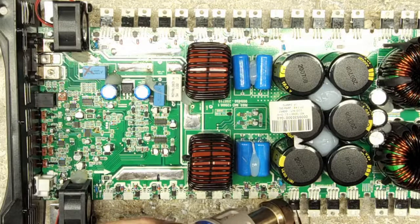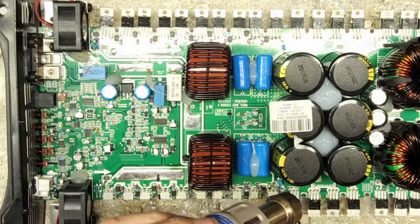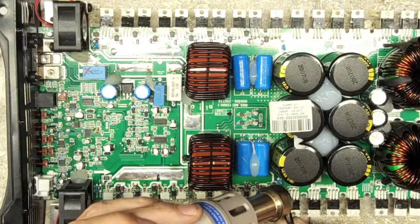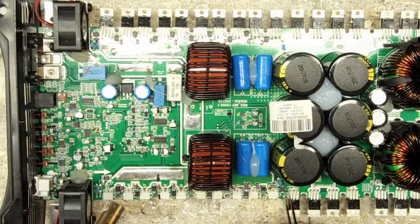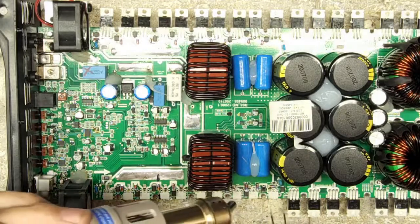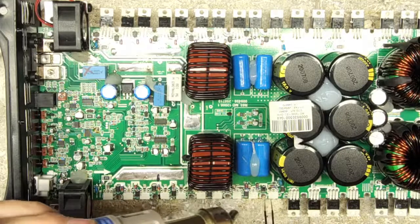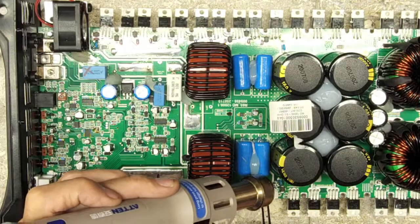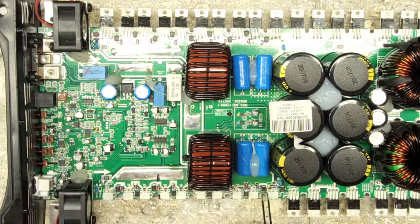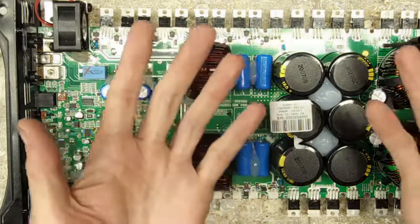So on the solder paste, you'll see that the puddle will dance around a little bit. I just use the air to guide that puddle around until it starts to melt, and then I set the component in place. I got one diode here that's a little crooked. You know me. Can't have anything crooked. I even go as far on through-hole gate resistors, I'll make sure all my color bands are the same direction too. Quality, right?